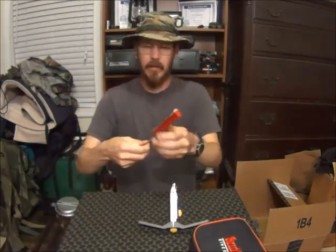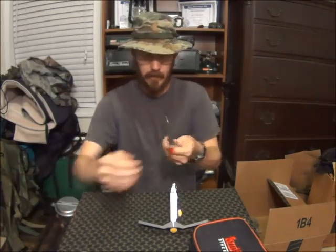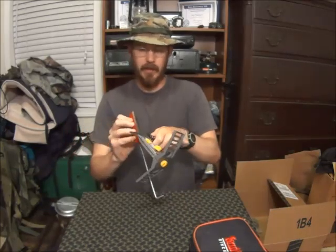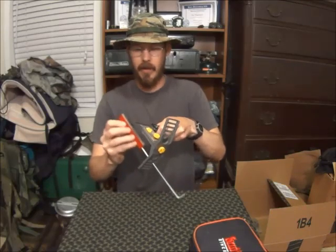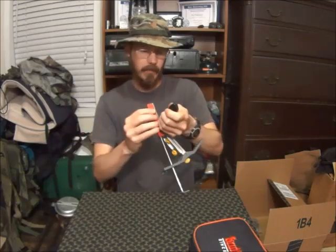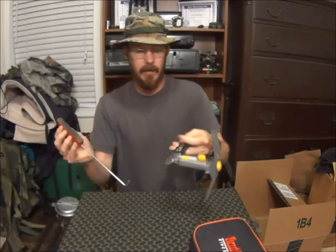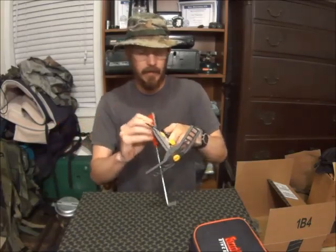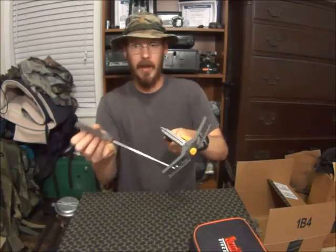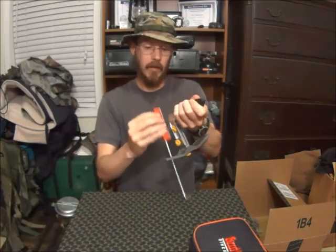Now, squirt a little bit of honing oil on your stone. It doesn't take much. And pick which one you want to use. I'm going to go 25 degrees because that's what I was doing with this before. You start out with little circular motions right here. On the other side. Now, as you can tell, this is going to give you a nearly perfect edge bevel here. So when you want 25 degrees, you're going to get 25 degrees.